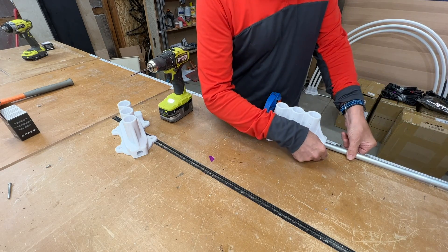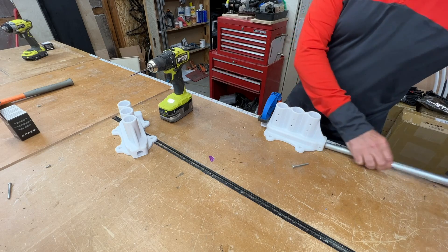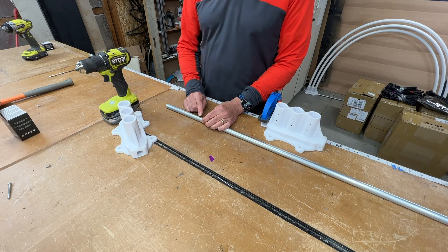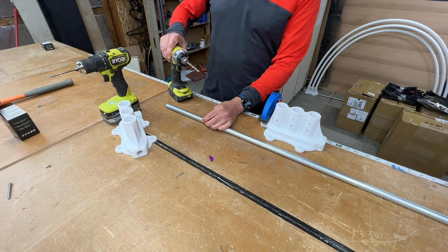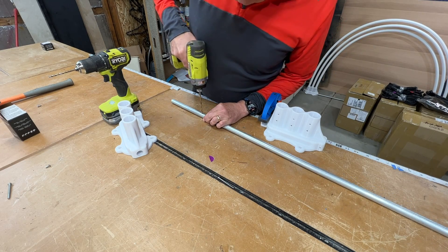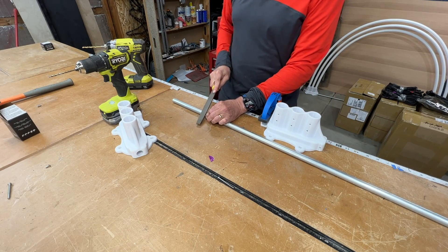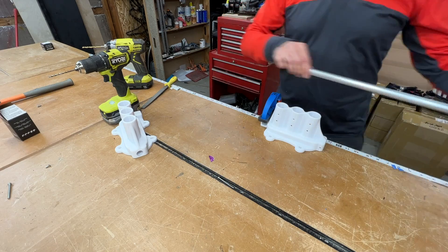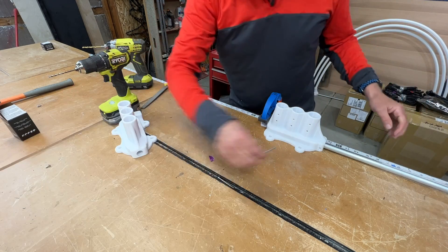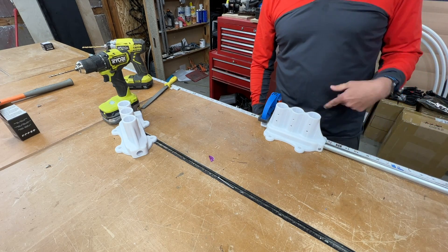You might find it still doesn't quite fit all the way through or it's a little tight. What I do is take out the EMT and ream the hole out a little bit larger — I go to a 3/16-inch bit, just a little bigger. Now everything's lined up just right. If you used a hand drill like I did, you might get a burr — get a file and get rid of the burrs. Now I'll be able to put the M4 screw all the way through, then repeat that on the opposite side.